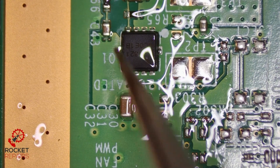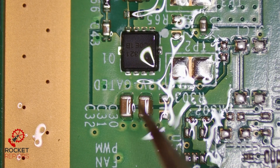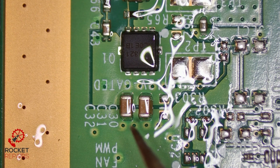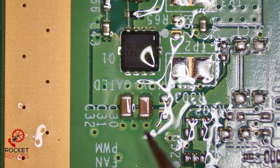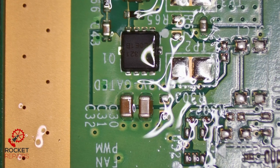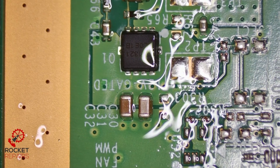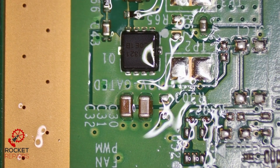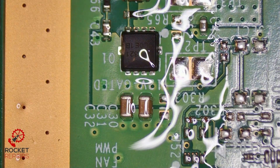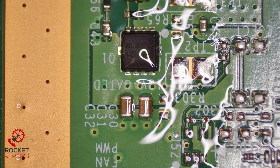So we have the MOSFET here. The main source of the heat was actually coming from the MOSFET. Isopropyl alcohol is our friend when trying to locate a very hot component because it evaporates quickly. I think again this cap looks like it's drying up the alcohol quicker. I'm going to be a bit naughty — I'm going to put up to five amps. This should increase the amount of heat generated, which may help us.